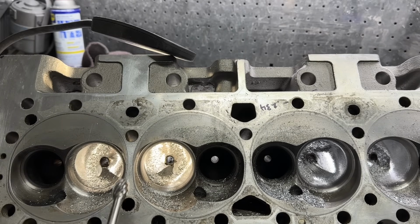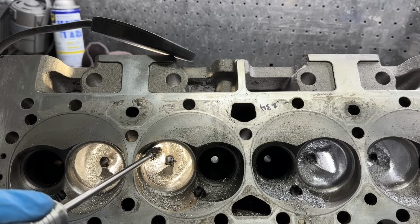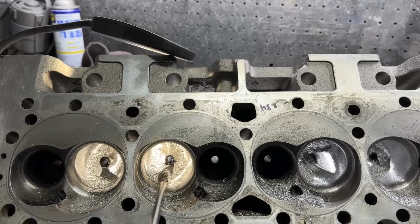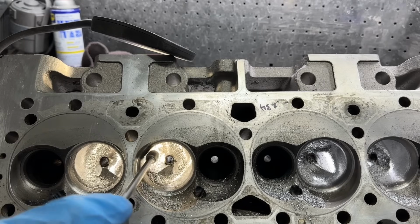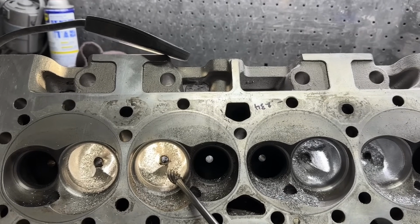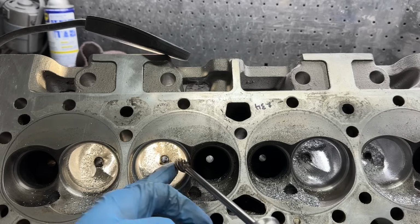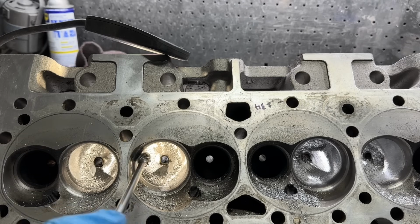Yeah, there are some cases where I'll make it perfectly even. So in that case, I'm doing the same thing here. I'm just doing the same thing over here. So it literally goes like that. So I still start here and come back over here, but I'm doing it this side. The way I'm doing it this side is the same way I'm doing it here. Because when I'm cutting the throat over here, I'm more flat against it. I'm barely rolling out compared to being way over with my porting, which I know this is a horrible view. Instead of being way over here when I'm doing it. See, I'm at an angle with the burr, so it creates an angle when it's cutting. As opposed to this side, I'm more straight and slightly leaning. Because I still want it to radius out.